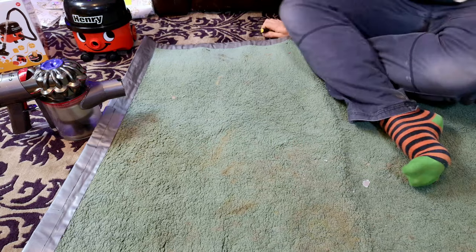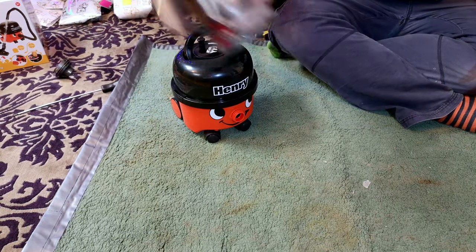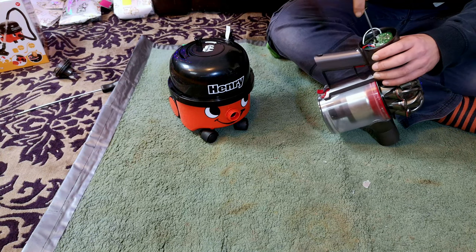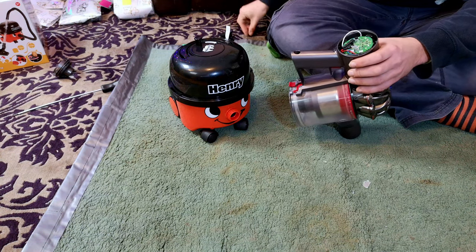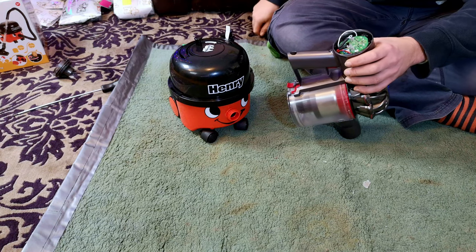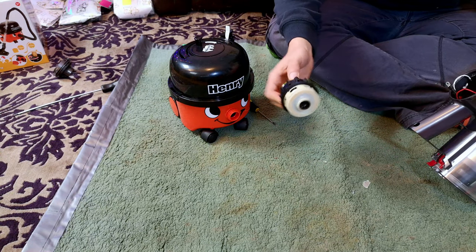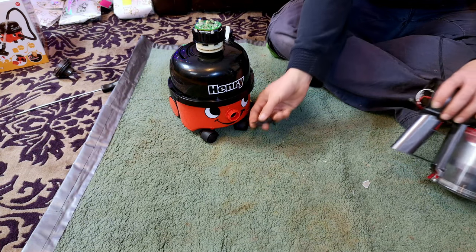Hello, my vacuum cleaner chums! How are we going to fit this into there? The Dyson is bigger than the actual toy Henry himself. Well, it's because we don't really need an awful lot. What we really need to do is remove these terminals - although we'll need these screws in a minute - like so, one and two. Then the motor simply pulls out... with it not pulling out. Ah, and that's actually the size of the motor. We may also need this rubber seal as well.